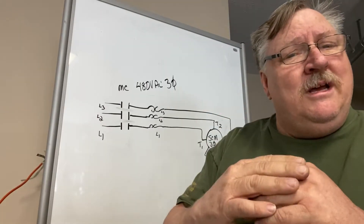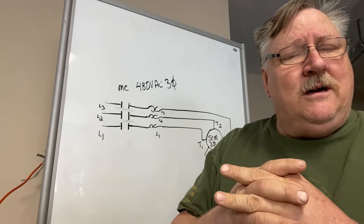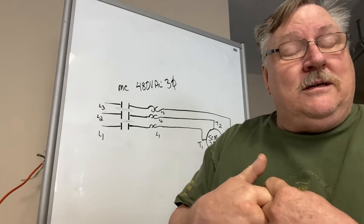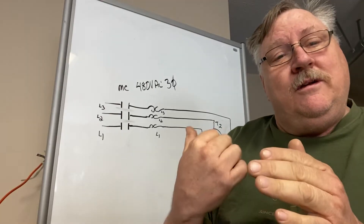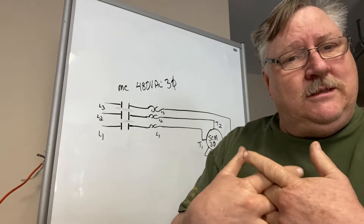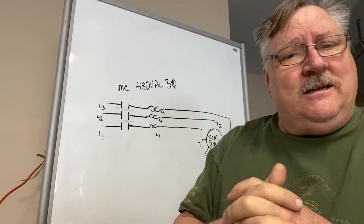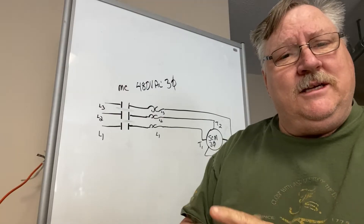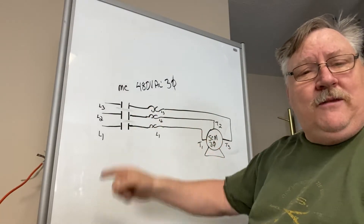You've got two that are pulling four amps and you've got one that's pulling nothing. You'll probably have a nominal current of like an amp on that dead phase, but those two have to pull the work that the lost phase is not doing. And that's single phasing. The next piece is to find out why it's single phasing — because it can be an issue at the motor or it can be an issue farther up the line.